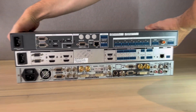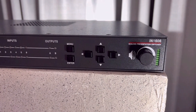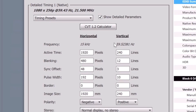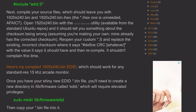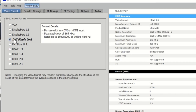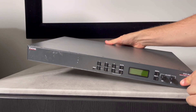The Extron DVS605 has HDMI in and RGB out, and would have been an ideal DAC-less candidate, but the initial unit I bought was dead on arrival. The IN1606 was the next most readily available scaler on the PCS compatibility list, and in uncharted territory, my initial efforts only had the custom 240p resolution running at around 56 frames per second, which caused noticeable frame skips. A guardian angel in the comments verified that the EDID method could run at 60 frames per second with a pre-made 240p EDID file found online, though this file was set to output RGB, which the IN1606 could not. And even if I changed the EDID to output HDMI/DVI, the results were still sub-60Hz. As the Downscaling Chronicles approaches its end, I wanted to give this method one more try with another DVS605.